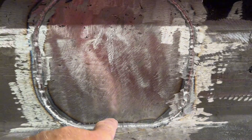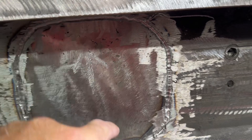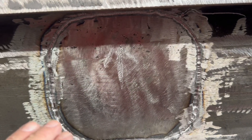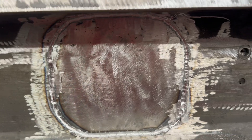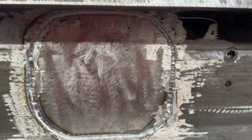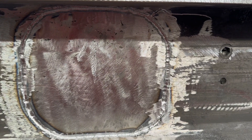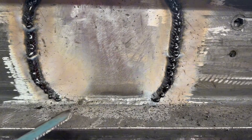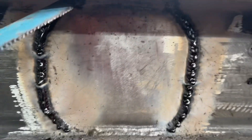We're going to give it a little bit more preheat — you only want about 120 to 150 degrees — and we're going to use some 7016 low-hydrogen welding rods. We'll start from around the bottom and work our way up, and from this side down. One run should do it. I'll set the power a little bit high because I like it to go in, but there might be a cap over the top which can be ground off. Then all we've got to do is fill the other side up.